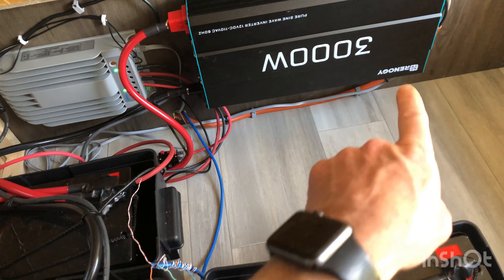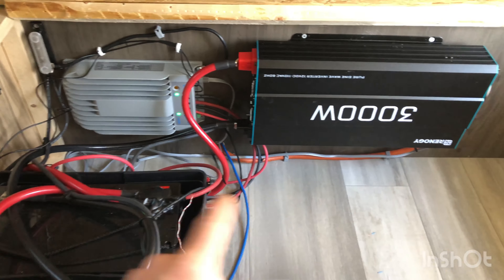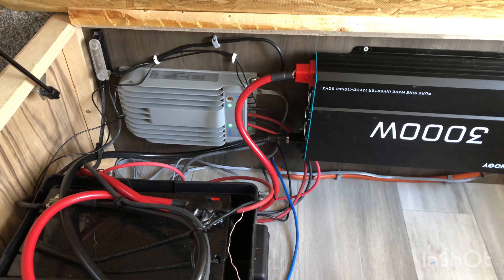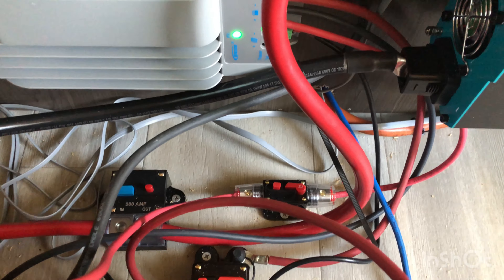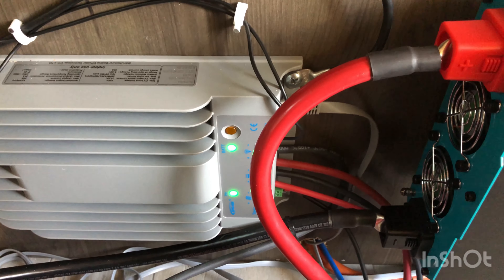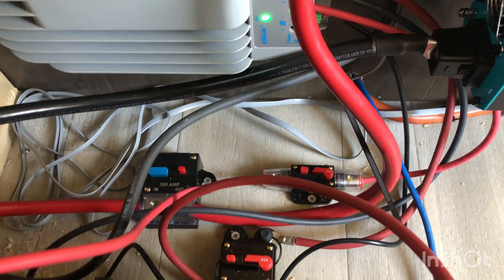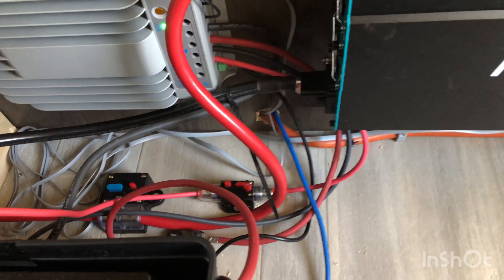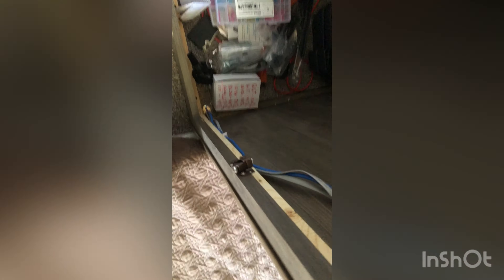Right now I have the wire coming out of the inverter going to that receptacle you saw outside. We're going to take this under the camper to the automatic transfer switch. I got a 10-amp fuse up on the roof. Right here I have a 30-amp feeding the charge controller and a 300-amp circuit breaker - these are all circuit breakers, not fuses, I stand corrected - on the 3,000-watt inverter. I probably won't even draw that much, and it also works well as a switch when you want to work on stuff.